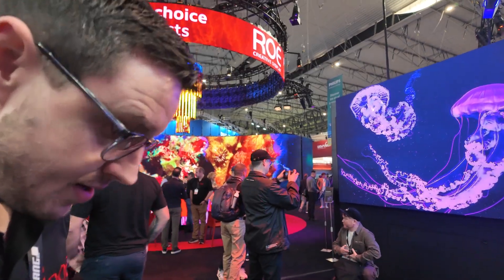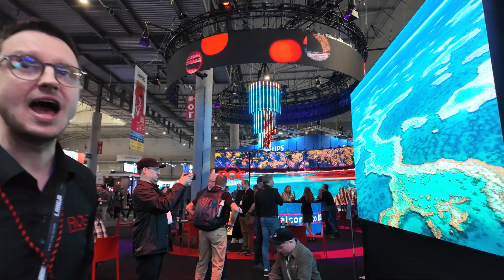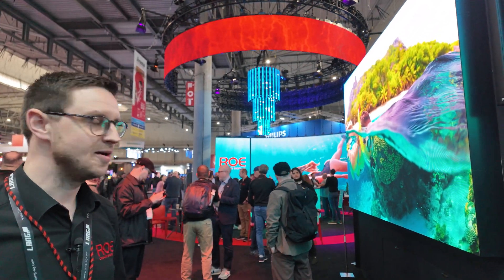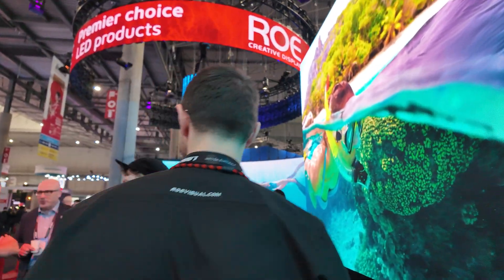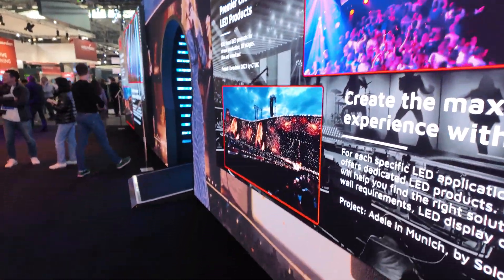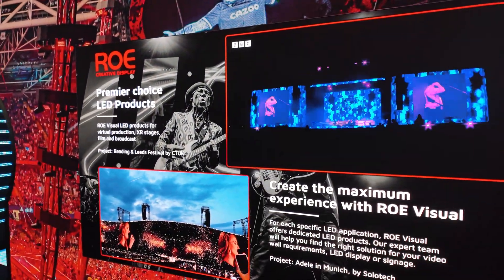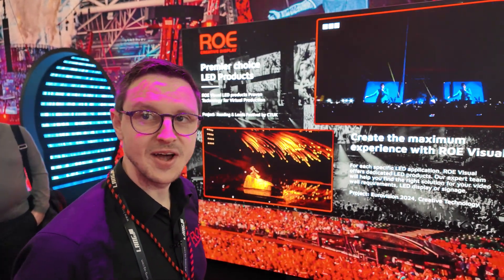What visitors at the booth really like most is probably the Denali, which is the 0.7 MIP — micro LED in package. This is a new technology where each diode is less than 100 microns in size, really pushing the boundaries of technology. This is actually a 4K resolution display, very similar to the pixel density you'd see on a 4K LCD panel. We're at 0.7 millimeters pixel pitch here, which for LED technology is very, very small. It's micro LED.